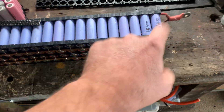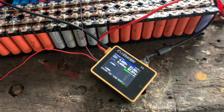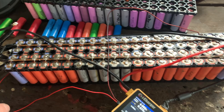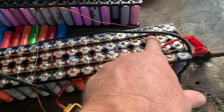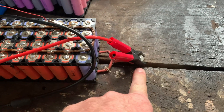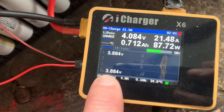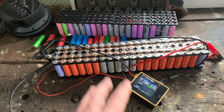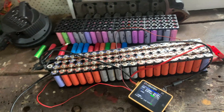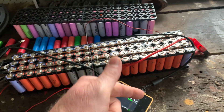I thought I'd take the chance to grab the Opus and actually test this. I'll charge and discharge it and we'll see what we've gotten capacity-wise today. The iCharger is out and starting to make some noise. I've disconnected the Longmon. I've got the positive cable and the negative cable here. With the balance leads coming out, I do the negative there and the negative cable there, and the balance lead for the positive there and the charging cable there. It's saying almost 4.1 volts, but the balance leads are saying it's slightly lower. We're going to leave this, come back in a couple of hours — she should be fully charged. Give her a discharge test. Leave a comment below — what do you reckon the degradation is going to be, how much lower?